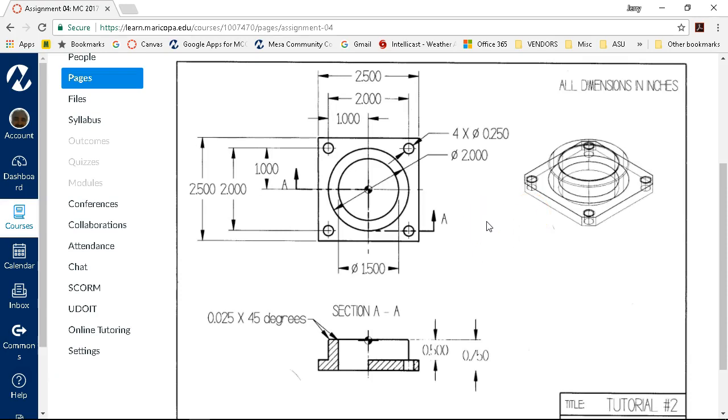Looking at the part, it's called out for the 25 thousandths by 45 degrees on the top edge. So we're going to run a contour with a chamfer setting. That would be either a countersink, or we'll set up a mill drill, drill mill, whichever way you want to define it. Basically the end mill with a 90 degree point ground on the end of it, capable of doing the chamfer.